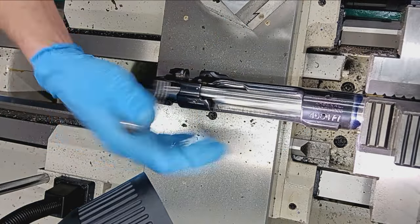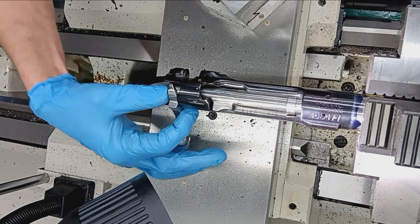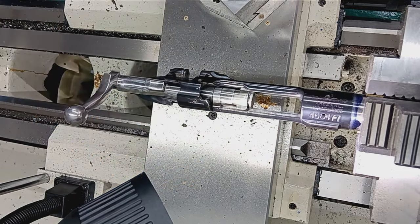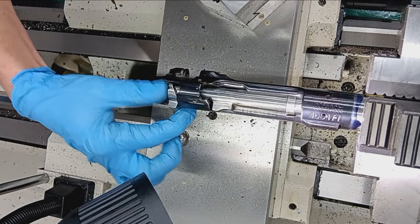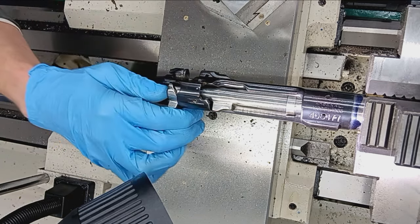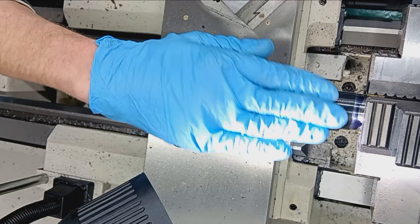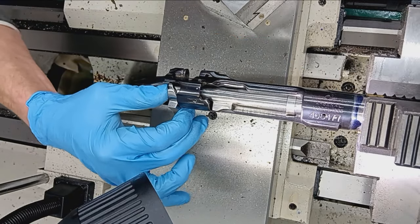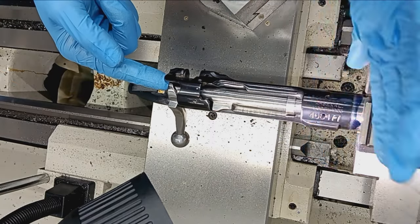So that's nothing in it. Still closes. See, the bolt's got play with nothing in the chamber, right? So, again, I don't have any live rounds or dummy cartridges to check, but just to show you the go gauge, see, there's nothing there. Now, there's a little play there just because the bolt is smaller than the raceway, and we talked about that earlier. So, engaged with the go gauge, the bolt has zero wiggle this way, meaning perfect headspace, perfect dimension.